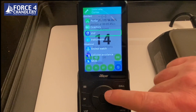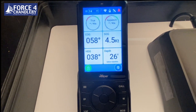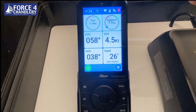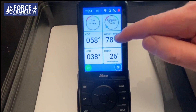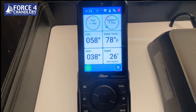The next page to highlight is a neat page called Instruments. Anything wired into the hub on the NMEA 2000 bus or via NMEA 0183 can be viewed here. So if you have wind, paddle wheel, and depth sensors connected, you can see all those functions on the display — effectively giving you a multi-function instrument in your hand. You can change the displayed instruments by swiping and locking, which is a great way of seeing what's happening when you're helming.